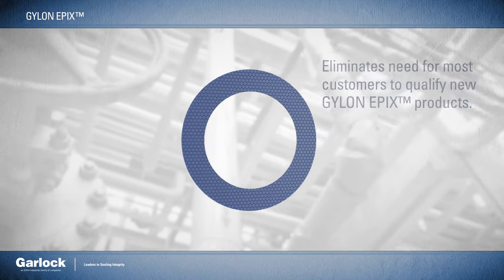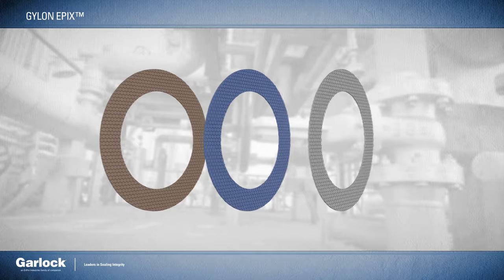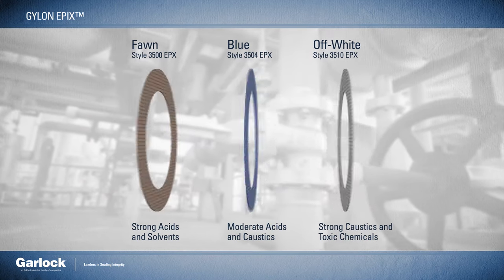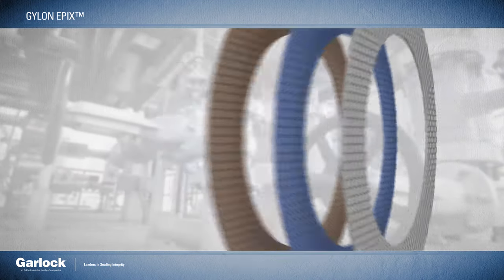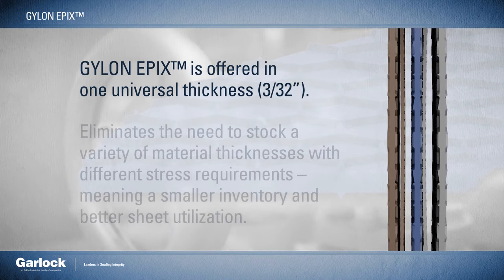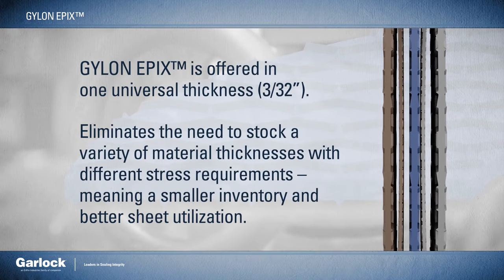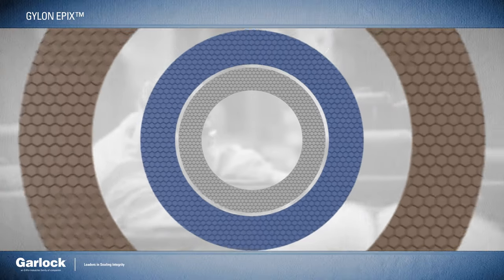In addition, this innovative new offering follows the same numbering and color coding system as all other Gylon products: fawn for strong acids and solvents; blue for moderate concentrations of acids and caustics; and off-white for strong caustics and toxic chemicals like chlorine and ammonia. Gylon Epyx is offered in one universal thickness — three thirty-seconds inch — thereby eliminating the need to stock a variety of material thicknesses with different stress requirements, meaning a smaller inventory and better sheet utilization. Garlock is dedicated to providing sealing solutions that meet real-world sealing needs.